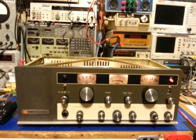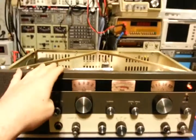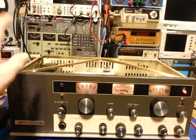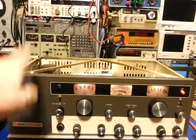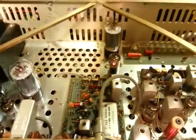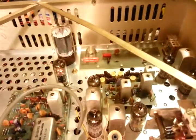This is just a quick video on the Tram I just uploaded tips and tricks on — what to and not to do when restoring one of these. It's now flipped back over. I've recapped the balance modulator board, cleaned up the contacts on the crystal channel selector board, tested and cleaned all the tubes. You can see the new can capacitors installed.